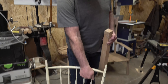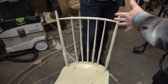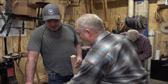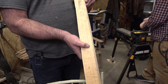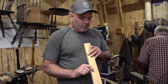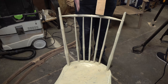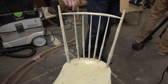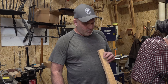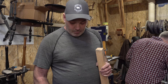Using this chair as an example, we need to make these spindles right here. You can see how they're quite thin but they've still got to be strong. My brain says that can't be strong, but based on what we just said about splitting — that maintains the strength. This one, you can see the grain is very straight. When I split it, it'll follow that grain, and after I get it in the chair while it's still a little green, it'll actually straighten itself out because it's held at both ends.